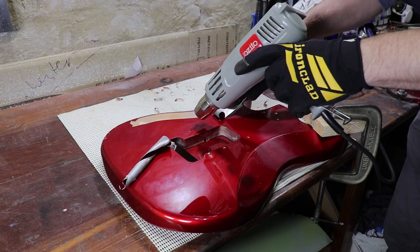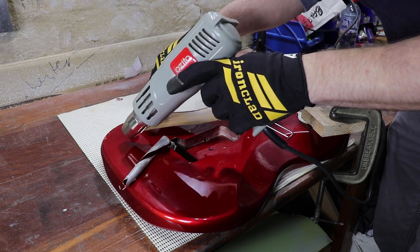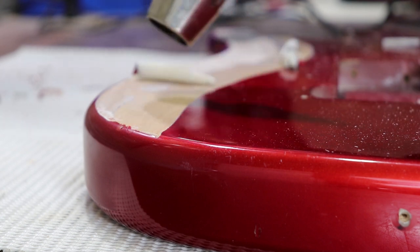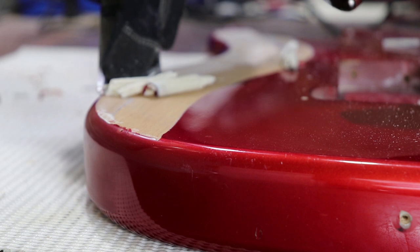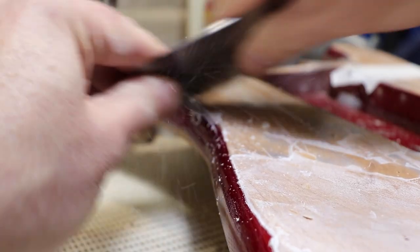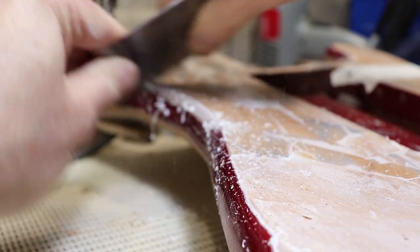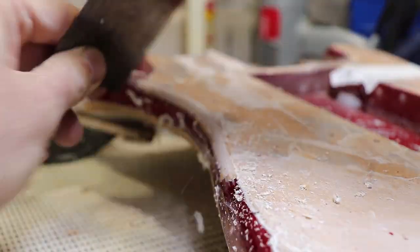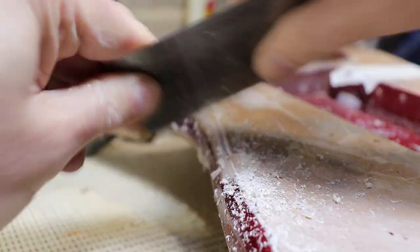If you've got a heat gun, that will certainly fast track the process, but that's pretty awkward in the cutaways, for example, and with the high-build sanding sealer that's underneath, because it's so hard and its thickness is quite unpredictable, it's very easy to gouge up the wood by mistake. For the edges, I use a cabinet scraper, aka card scraper. It actually makes pretty short work of it, but you certainly need safety specs because that really hard poly just kind of shatters and flies everywhere.